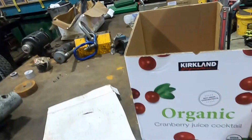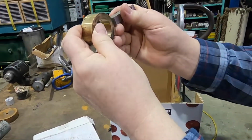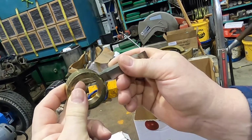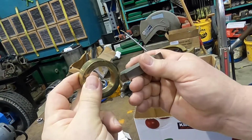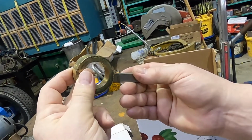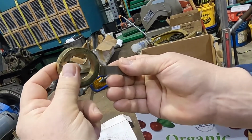And then we can look at the outside similar, where it's just the opposite. Up here, you get out of the cutting edge really quick on an external if you're too high. And on the other hand, if you were low, you could even have a tool that was excessively raked back if you start going lower.